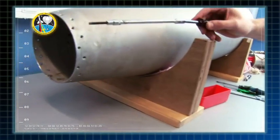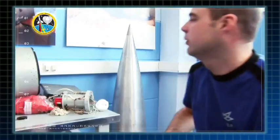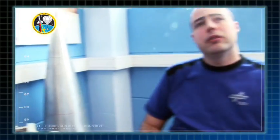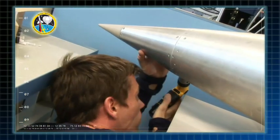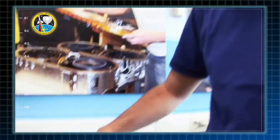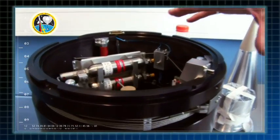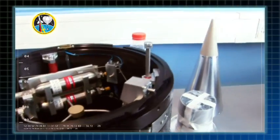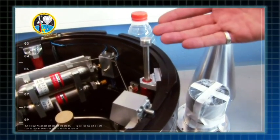What you see here is the rocket's nose tip, and we have two different types: one is ejectable and one is fixed. You can push away the forward tip that pushes against the cylindrical part of the payload, and then the nose tip will move away. As this is a quite nice and expensive part, we would like to recover it, and this is why we have a small parachute recovery system inside this nose tip. The payload separation system here works quite similarly — it's also a pneumatic system driving plungers that push the payload away from the burnt motor.